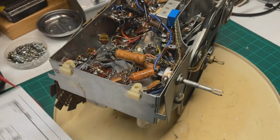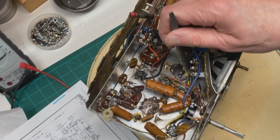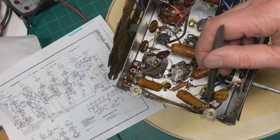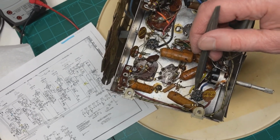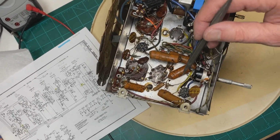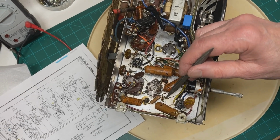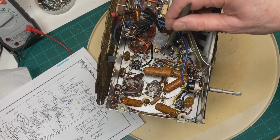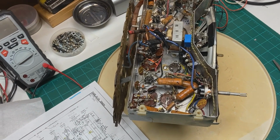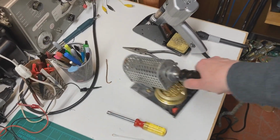But if you look real close here, this yellow lead coming right here is the one that goes right over to the output tube, and it's pin 2, I believe, yes. And you could very easily just put in a small electrolytic 47 microfarad capacitor and just tie it from pin 2 to ground. It's real handy right there, and that'll save you having to try to stuff another one inside that, and it'll probably sound better anyway.